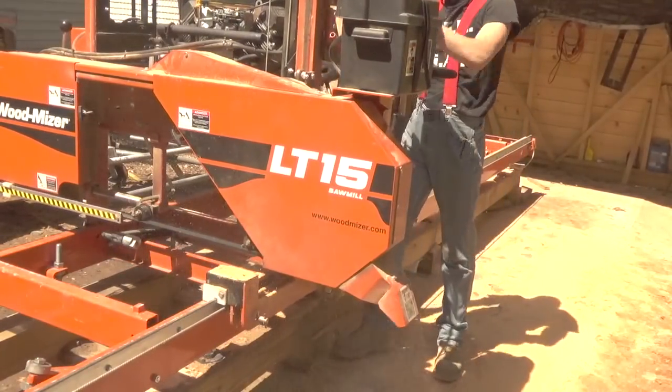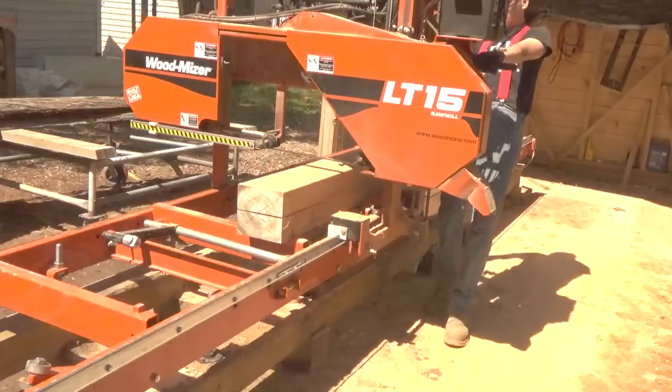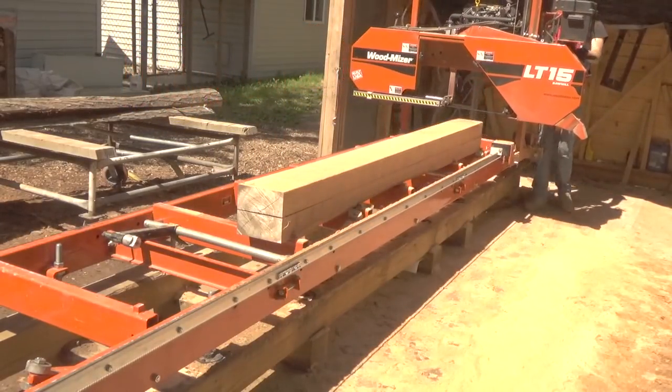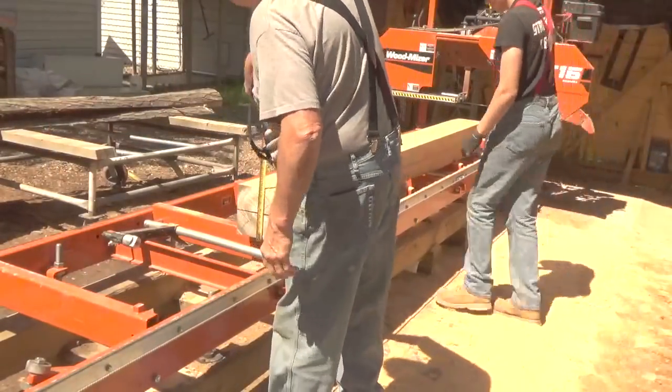What we were doing there before when we were testing, we're trying to find the exact center of the log, and without doing math, what we do is just kiss the log, go down what we think is half, touch it with the soft cut, and then measure the cut. Okay, take the gun off the front, bump over and cut closer.